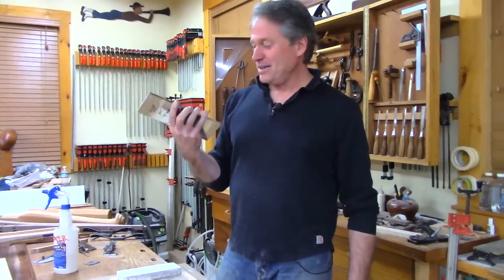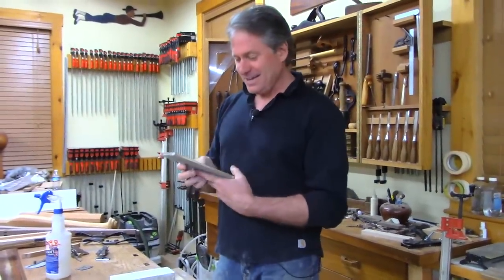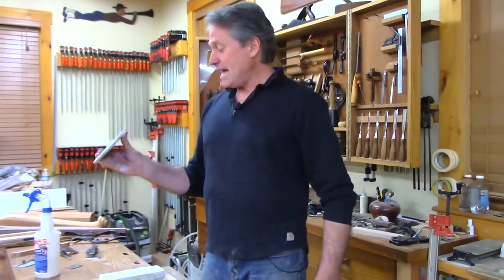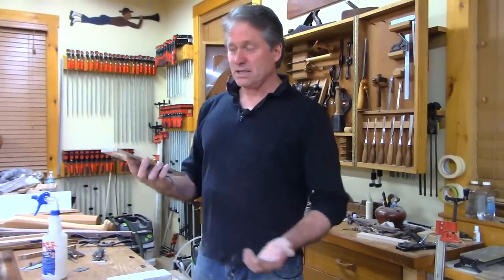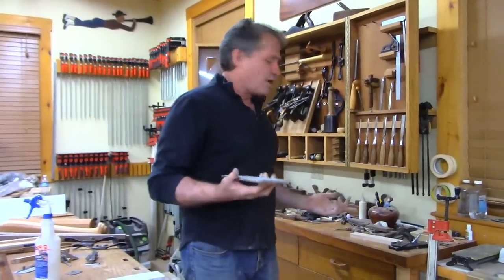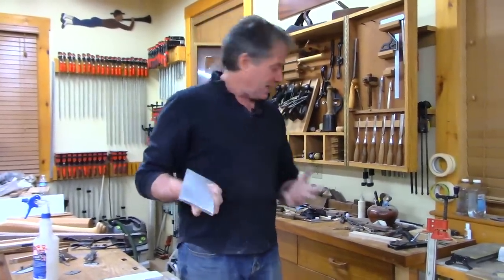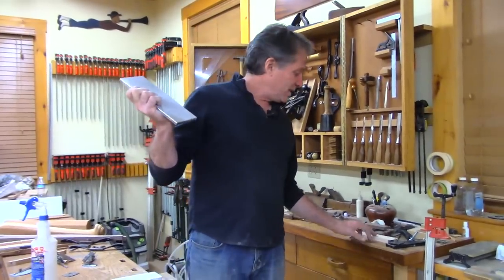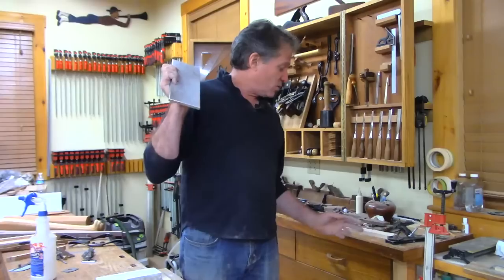Angels, whatever, sent me this recently. You know who you are. Thank you very much again. I held off getting one of these for so long, and someone heard me and was wonderful to send me this gift. This is a DiaFlat 95 lapping plate. They're like $200, a little over 200 actually, but it's a diamond plate. There's a 95 and there's a 120 micron. The 95 micron equates to about 177 grit, or about 180. The 120 micron is larger crystal, so it's a coarser grit. It equates to 138 grit, or 140.